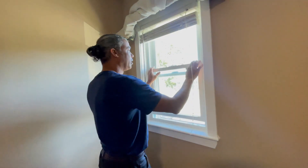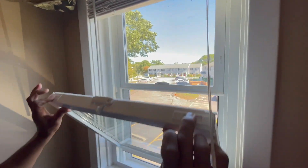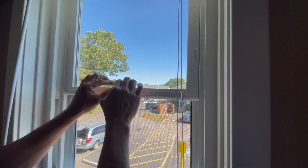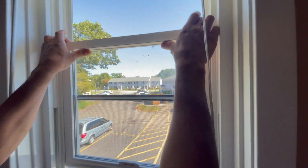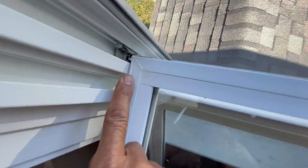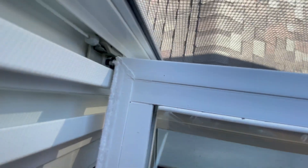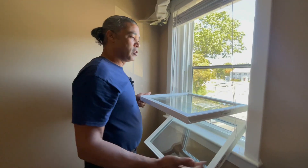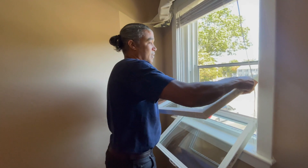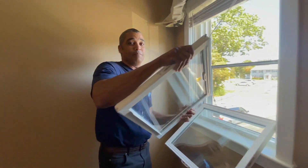It's really simple. What you do is you open the window and unlatch the bottom part. In this case, it is our top window that's broken. We're going to pull it down and unlatch it. If you can look at this mechanism in here — focus right in there. You're going to set the window horizontally on the frame, and you can pick either side, one or the other, and just lift up on it at an angle like that and take it out.